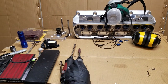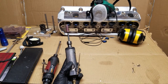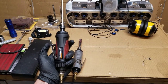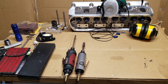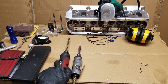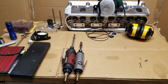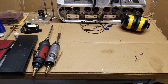This particular unit I've had for probably 22 years. This thing has done a lot - just oil your tools every day and they last a long time. Here's another one - this is a composite body die grinder. The way I like to use it is I just use my air pressure to vary the speed of the tool. When I'm working heavy stuff and need to get some metal knocked out, I'll bump that PSI up to about 60 or 70. When I'm working in tighter areas where I really gotta be careful, I'll knock it down to about 25 PSI so I can be real careful in those sensitive areas.